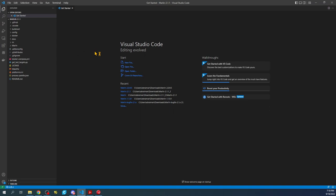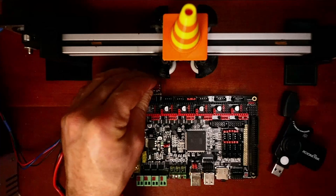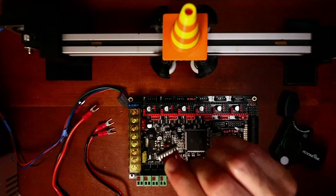While that loads, let's go back to the desktop. This is the TMC 5160 Pro — it already has a built-in heatsink. On the bottom you can see the pins and how they line up. The yellow side will be closest to us on the red side, and black on the other side. We're just going to plug it in.